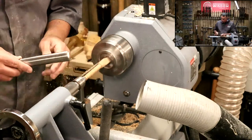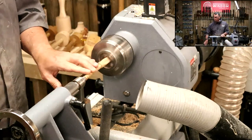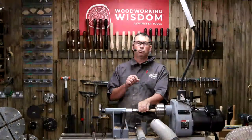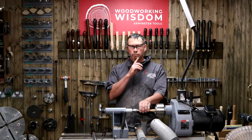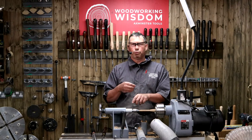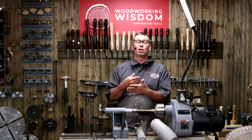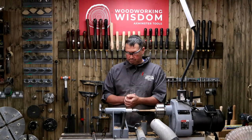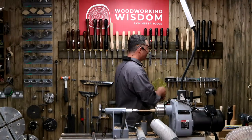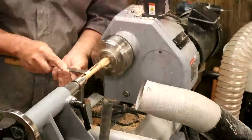That's great. Frederick's asked, what's the gold coating on the brad point bit, please? Always wanted to know. So it's titanium nitride. It used to be used on things like turning tools as well. You'll see it on some Forstner bits, sawtooth bits, brad point bits. It's a harder coating, so it's designed to make the edge last longer. I think that's all it does, isn't it? Makes it look pretty. Yep, looks great as well. There we are. So, of course, we're going to skew that surface.